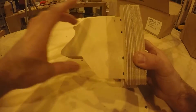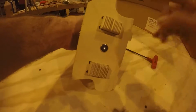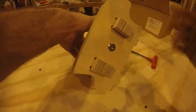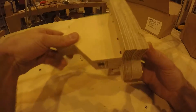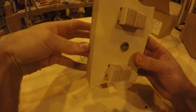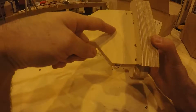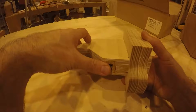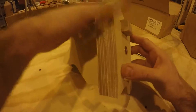But this is a stretcher, so this would be like a table stretcher, and this is the table leg. And you can see I just did kind of a cutaway drawing and just milled out the pieces that I wanted to test out. So the idea here is I wanted to make a joint with an exposed bolt here, but a fastener that was inside here but totally hidden. So if we look in the bottom, this is actually the insert that has a thread in it that pulls this together tight, but I'll get to that in a second.